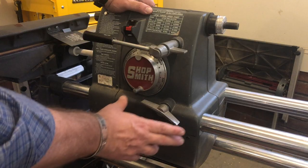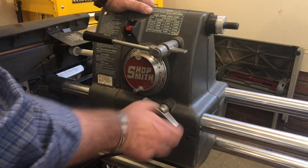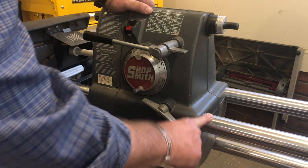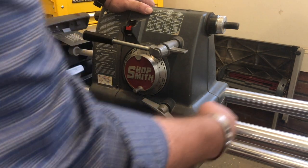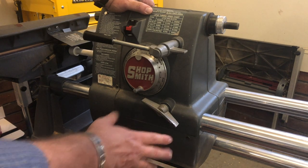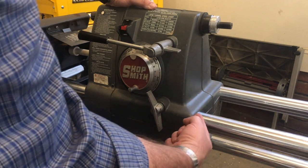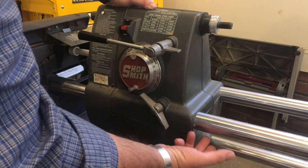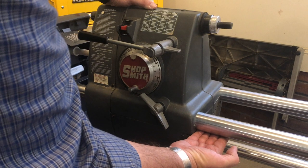What's going on? The headstock is locked in place by two metal wedges — one located here and one on the opposite side of the headstock. When you turn this handle, you are rotating a threaded rod that pushes this wedge forward into the top of the way tube, while at the same time pulling the other wedge to the top of this way tube. If you think about taking a wooden wedge and driving it in at the top, it would lift the headstock up. When the headstock is loose and sliding around on the way tubes, any wear is going to be on the top side of the hole in the casting. But when we tighten this, we're driving the wedge in, which lifts the headstock tight against the bottom of the way tube. So the wedges press against the top, and the headstock casting is lifted into contact with the bottom.